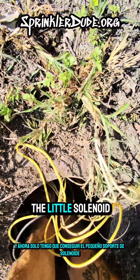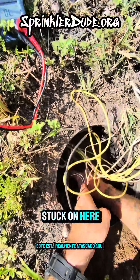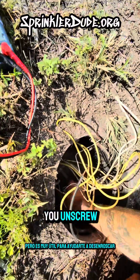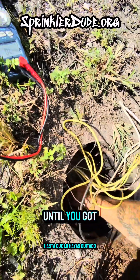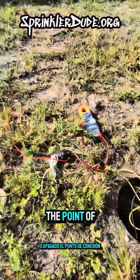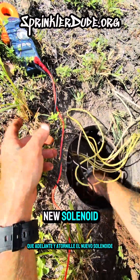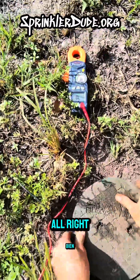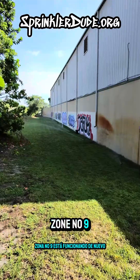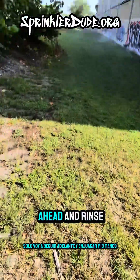With the dirt cleared away, I just need to get the solenoid holder out - rock it back and forth. I've got that ring which is actually super helpful to unscrew - use it as a tool to unscrew the old solenoid until it's mostly off. The system is totally off; if it were pressurized I would have closed the flow control or shut down the point of connection. We won't need the extra bushing - there's already one in the valve. Screw in the new solenoid, use some waterproof wire connectors, and let's test it. Zone nine is working again!